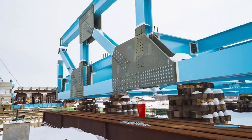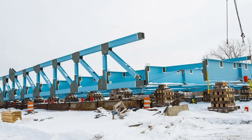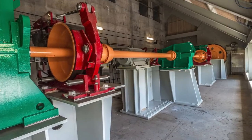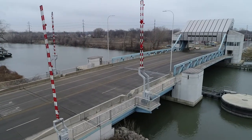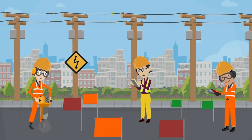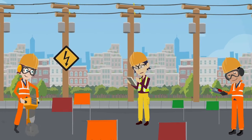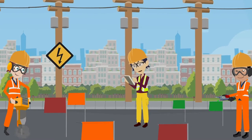The fabricator had three separate plants fabricating all the structural and mechanical components, because one plant couldn't handle all the work and the large quantity of components. There were many utilities that had to be relocated to construct this new bridge. During the design process we always try to locate all utilities and identify and plan for ones that will be in conflict with the proposed work.